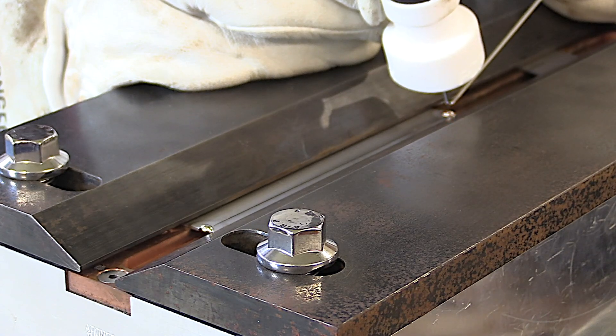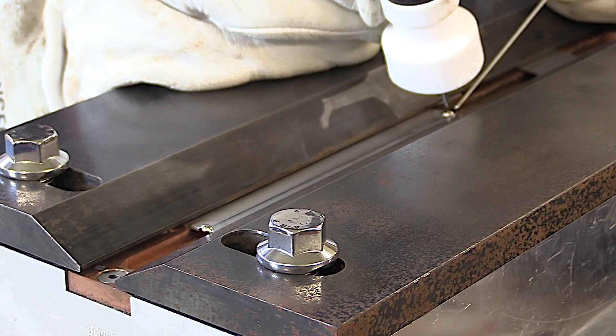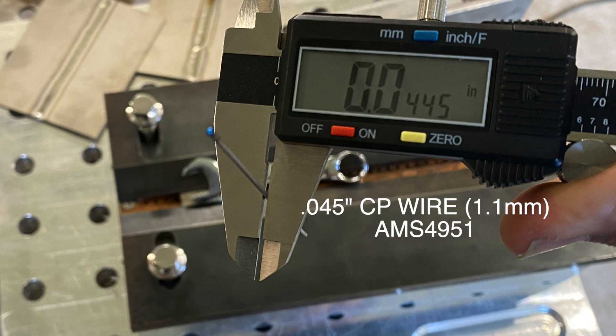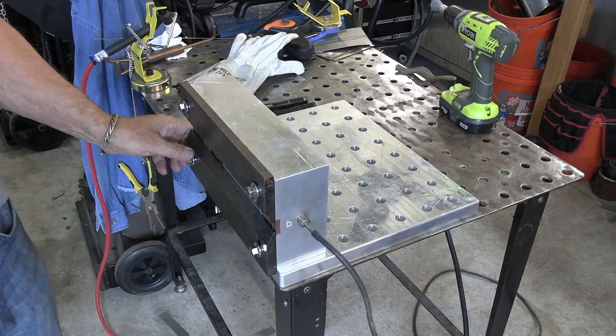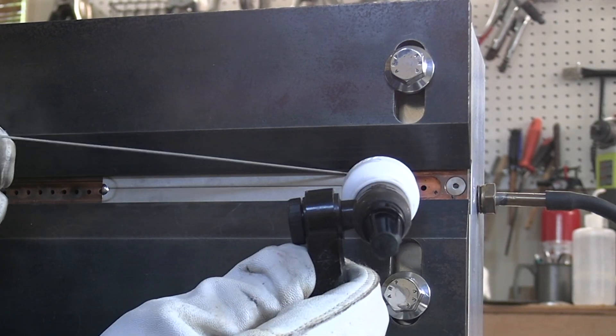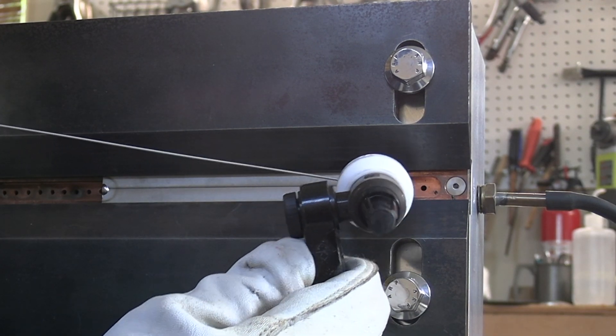When welding to and from the end without melting it away, you really need to get into the habit of holding your torch still while your post flow argon times out. For this test I'm using 0.045 commercially pure filler metal — I'd kind of like one size up just for the rigidity, because titanium is so sticky. The 0.045 tends to flop around a little bit, and when it's hot it tries to stick to the base metal. If you just move forward and tug on it, sometimes it'll come loose. I'm trying to feed it right under the arc into the fluid part of the puddle so it won't stick.